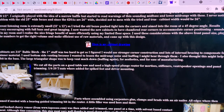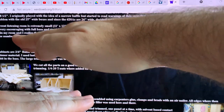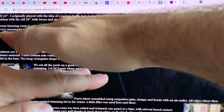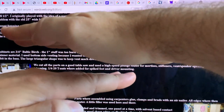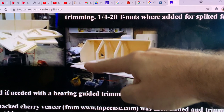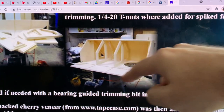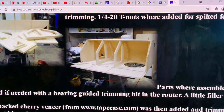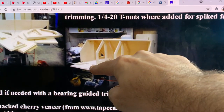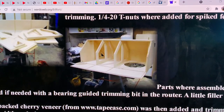However, you are going to lose that double bass effect. Your face plate and back plate can no longer dilate and come back and work like a true double bass, because the internal support keeps them rigid. Instead of being able to create that single big movement corresponding to the lowest frequency this cabinet could support, the divisions mean only smaller sections can move. Now you are depending on your port to fill out the bass.